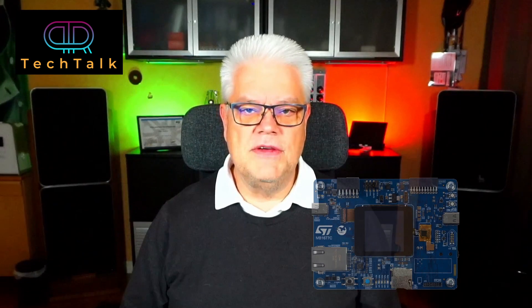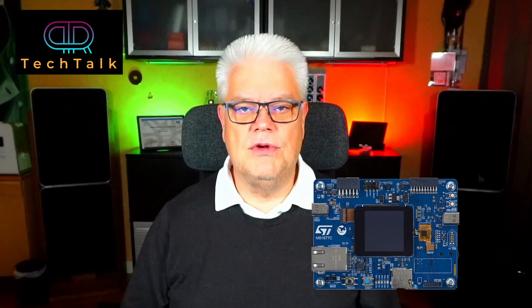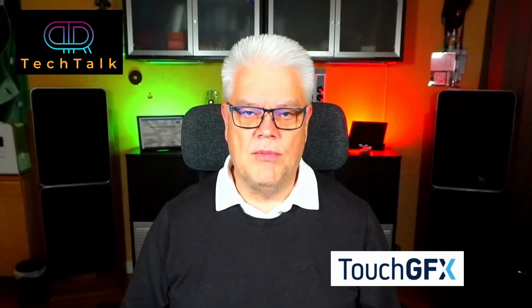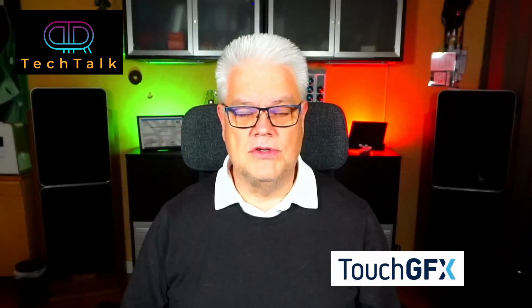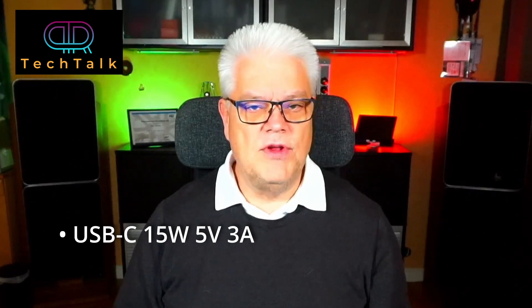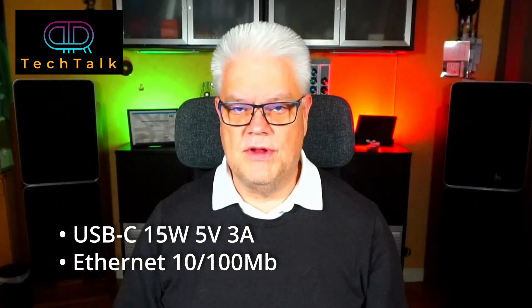It's in a 176-pin UFBGA package. It also has a TFT display which is 240x240 pixels on a 1.54 inch screen. It also packs a touch panel and runs demos using the TouchGFX graphic library, delivered without extra cost — you just need to download it from the ST site. It's packed with interfaces, all USB-C connected: USB 2.0 full speed with a 15W 5V 3A source/sink port, and it also has an ethernet with a 10/100 megabit ethernet jack.